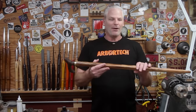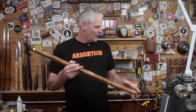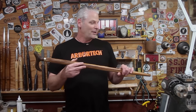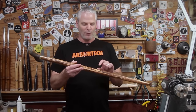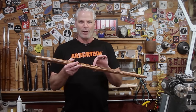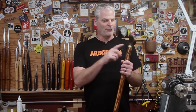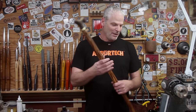One other thing, if you don't have a lathe, so this part of it is 33 inches, so I had to hang the headstock and the tailstock. I pushed them out as far as they would go. They were actually hanging out over the edge a little bit. But if you don't have a larger lathe to do that, you can still do them in pieces. Woodcraft sells a little kit where they thread into each other, so you can do two small pieces and then have a brass ring there in the center of it. And that little band is from when I used to make duck calls. It was one of those, and I just had a couple of spares laying around, but it worked great.